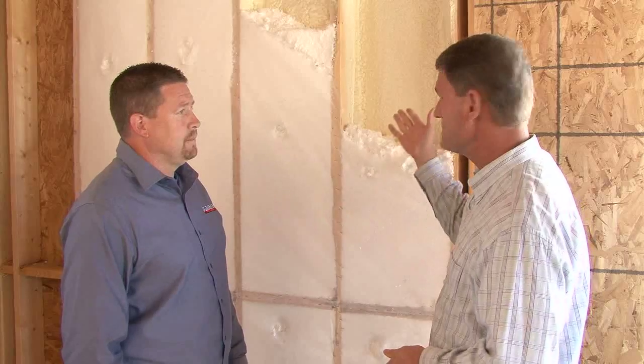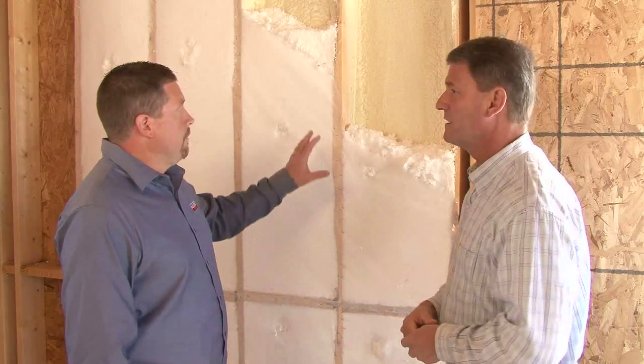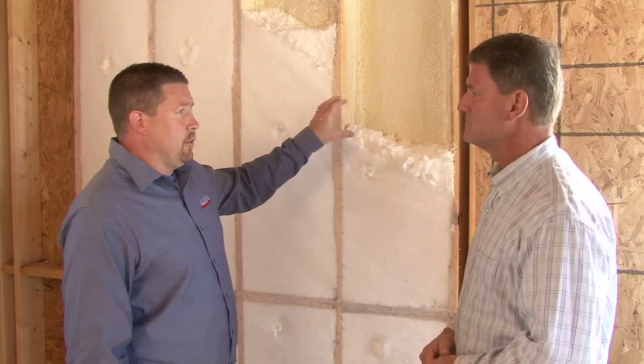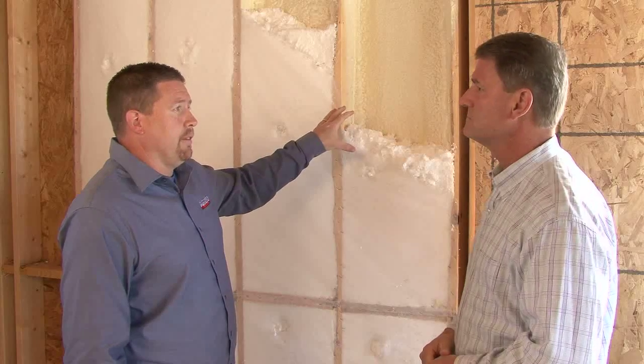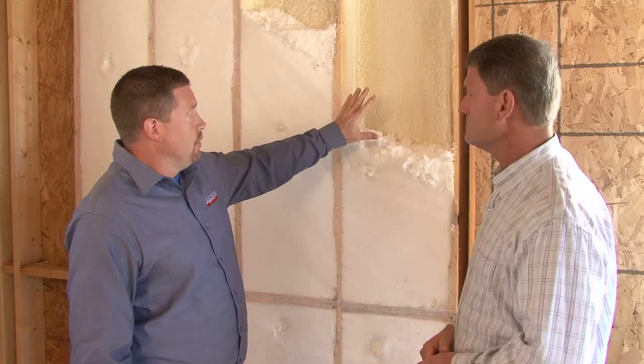You used closed cell. Tell us a little bit about your closed cell foam insulation. Well, closed cell foam has tiny cells that basically stay trapped when it's sprayed on, and that traps the gases and leads to strength and R-value. In this particular application, we put on about an inch and a half to two inches to help give us a good sound air barrier, a vapor barrier, and help add to the overall efficiency of the wall.